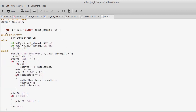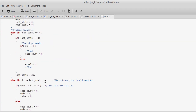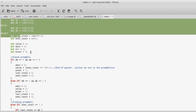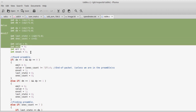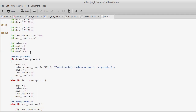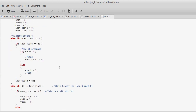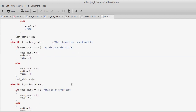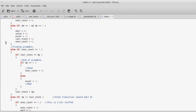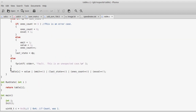And so one of the things that I did is I started to just simulate my code running on it. Now, if I want to interpret that there, it actually takes all of this code here. For every single bit that it has to interpret, every 1.5 millionth of a second, or if I can do the USB 1.1 full speed, 12 millionth of a second, I have all of this code here has to run. There are a lot of things going on, just a ton of things that have to happen, and you have to check for, and you have to jump around, and you have to test. So there's no way this would work in that little bit of time. This would also produce a fair bit of code, and I just don't have the resources to execute all that on the ESP.